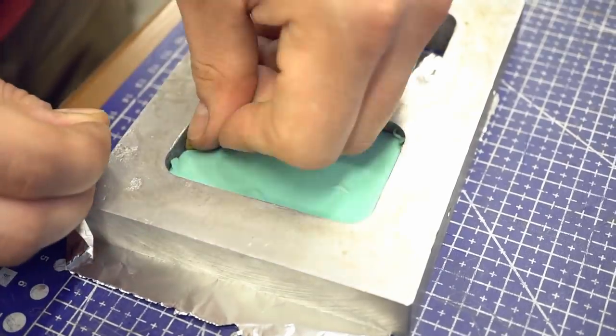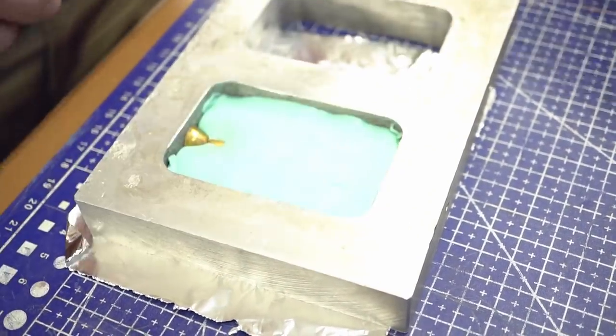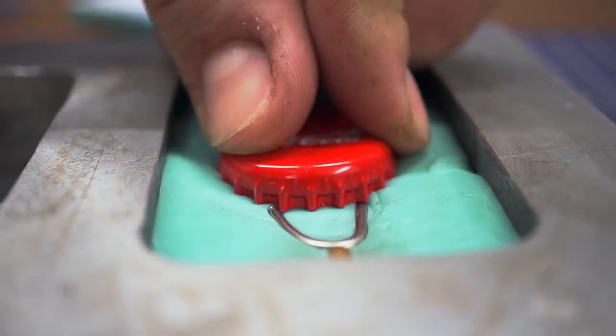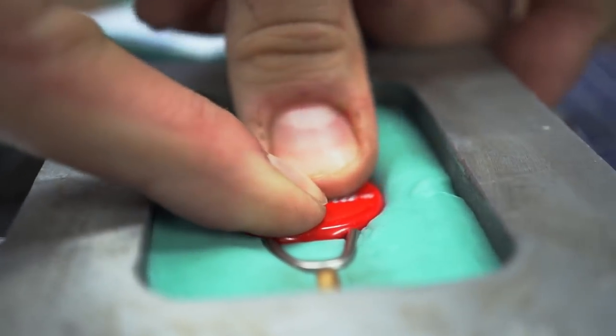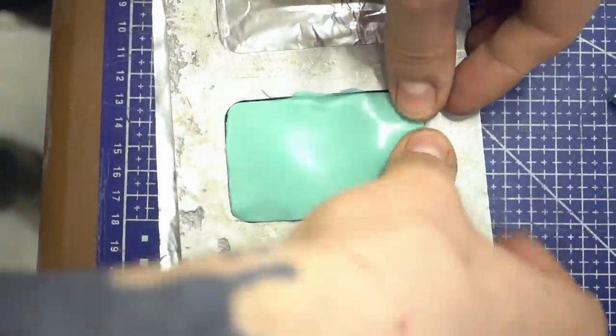I'm going to do the first shape on a vulcanizer. Hold on, before you go to the comments and complain that these aren't domestic conditions, know that this process can be done with your hands, using silicone. The only difference is that the rubber will harden in an hour, while the silicone will take a day. Just be patient and watch.